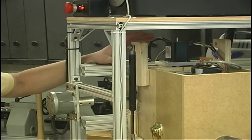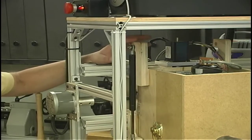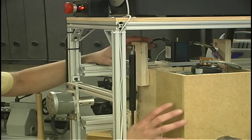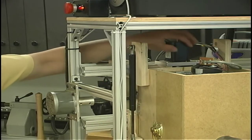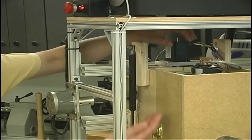One of the problems that came up with the design of the machine is that the Z-axis, this up and down motion, started losing position, and you obviously don't want that in a CNC system. Now, at first I thought it was because of the heavier spindle motor, spindle cartridge and so forth, and this extra weight of the box out here. All this has to be carried by the Z-axis motor. The more weight we have here, the more work that this motor has to do to move it up and down.